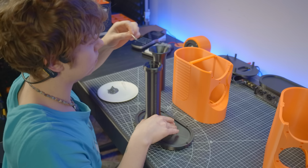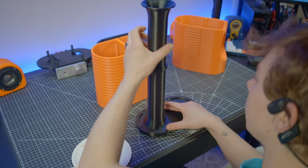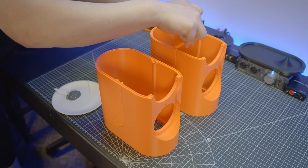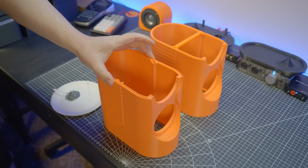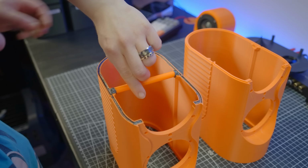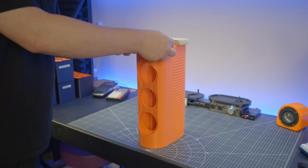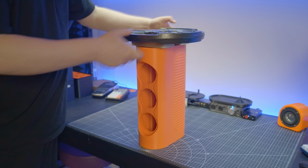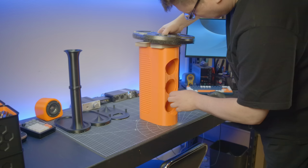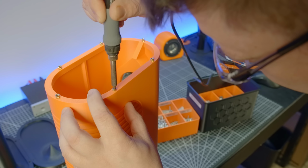The next order of business is to get everything glued, and here's Sophie JB welding the vent extension. This is also where we add in the brace, and you can already see the difference just squeezing the two halves. So, with everything thoroughly slathered, the enclosure comes together. A couple of spacer blocks and a 25-pound weight just to make sure that it doesn't blow away. The following evening, we have a very sturdy piece all set for the threaded inserts to go around the sides and the front.